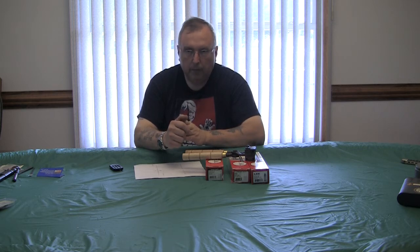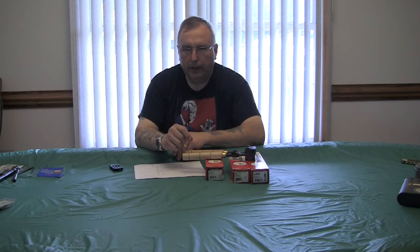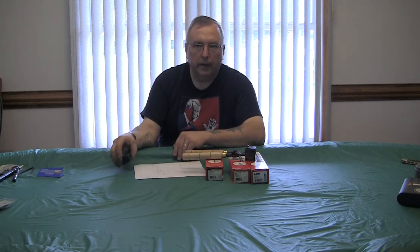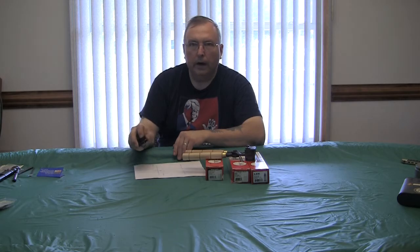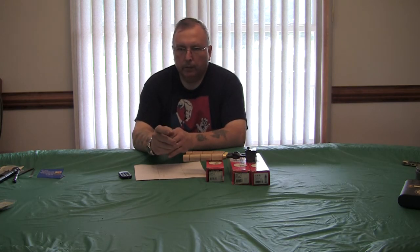So now on to black powder — why black powder? Black powder is a little different. You want a bullet that is soft, like the original ones. They weren't hard cast; they were actually swaged on a machine in a soft alloy of lead. With a black powder load — the way it worked originally, which we can't exactly replicate — they used swaged bullets which were stamped on a press, not cast bullets. Cast bullets, no matter how good you are at casting, are not the same thing as swaged bullets.